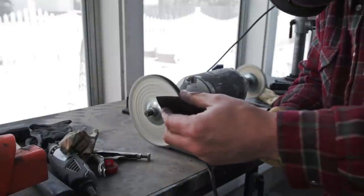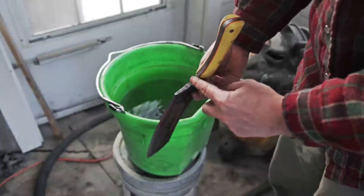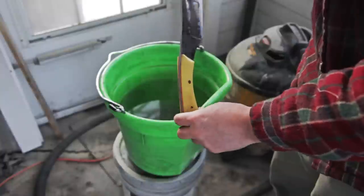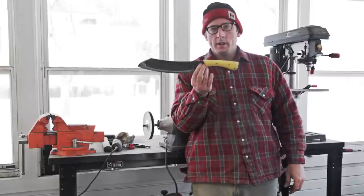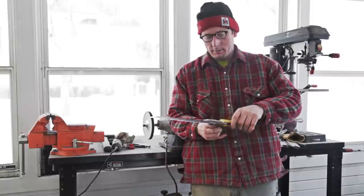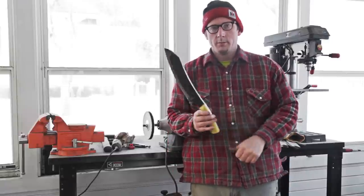The key points I've learned from starting with lawnmower blades are the right balance, handle shape, curved blade shape, full convex grind, and the choke up area. I've also refined the steps in actually making the blade. While mower blades are not the ideal steel for blade making, they did let me start relatively inexpensively and to make mistakes without significant expense. So that's the completed product — shaving sharp, although it really doesn't need to be. Just a fine little parang. It's got great balance. Balance point is right at the plunge line, which is about where I like it. Should perform well — you'll see it in some videos. Thanks for watching.